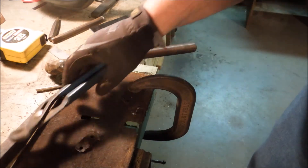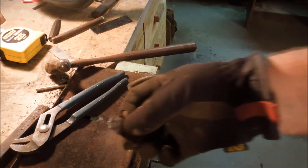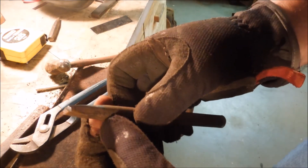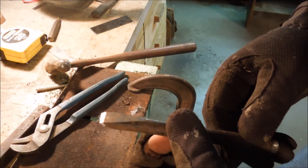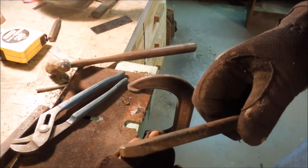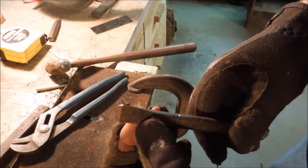There — done. I think my chisel was just a little bit too hard. This is one I made in blacksmithing class, and I left the temper hard because it holds the edge a little better. But I think I put too much load on it and I fractured that corner.